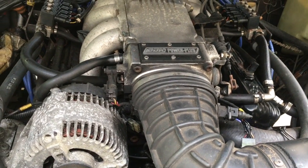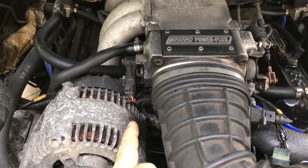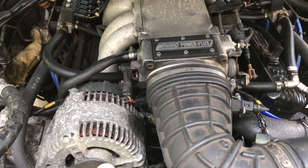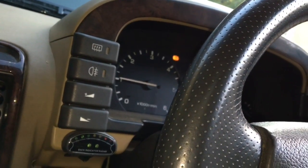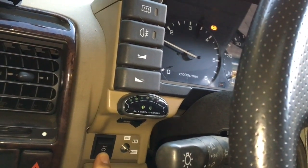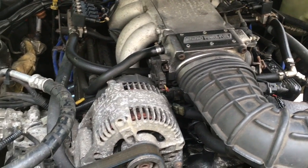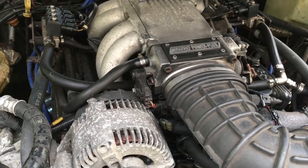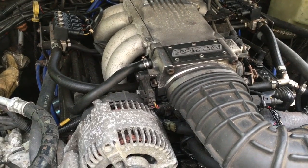What I'm going to do is have a switch-over so that we can either have the IAC valve, the idle air control valve, controlled from the ECU like before, or switch to an alternative position. I'm going to make and install an electronic circuit with a little rocker switch that we press to make the idle speed go up or go down. In my case I want manual control over the idle speed because occasionally when it's driven from the ECU it sticks in the open position and the idle speed is too high.